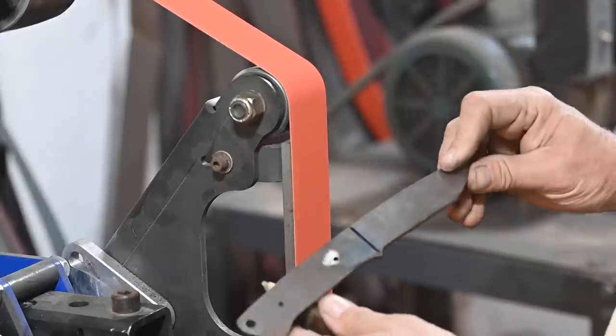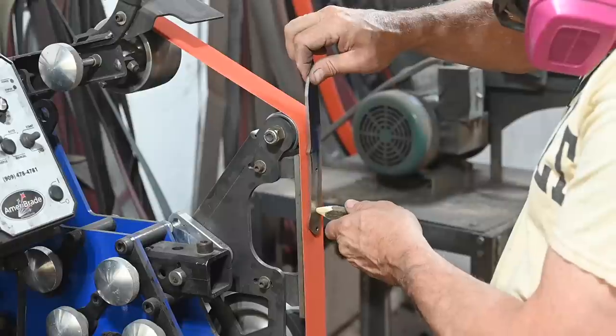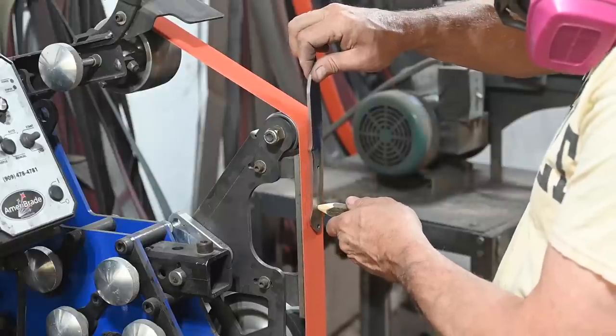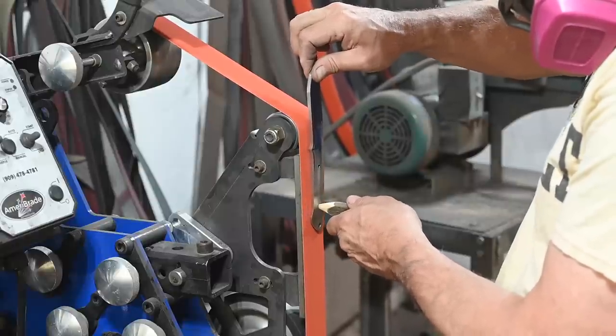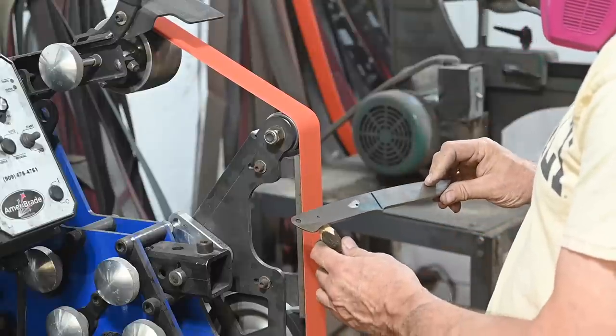The book shows some kind of little tool he uses to apply pressure to the lower tang hole, which helps apply extra pressure to the part that requires the most grinding. I just use this piece of wood, ground to a point so it'll fit in the hole — does the same thing, a lot easier to make, and it works great. There are tons of ways of grinding tapered tangs, including using surface grinding attachments on your grinder, but this works absolutely fine. I've marked exactly where I want the taper to terminate, basically right at the bottom of the eventual location of the guard. Once I start getting close, I'll change to a 120-grit belt just to avoid putting inadvertent scratches up on the blade.